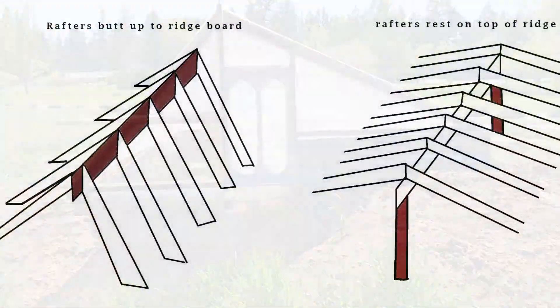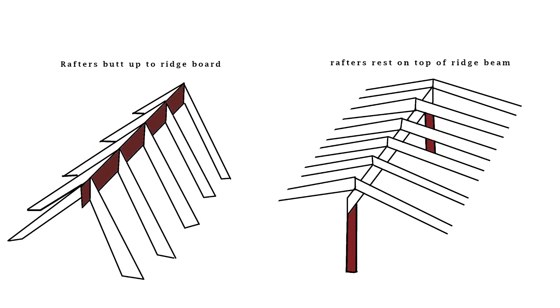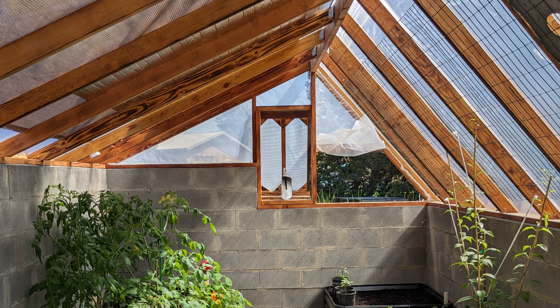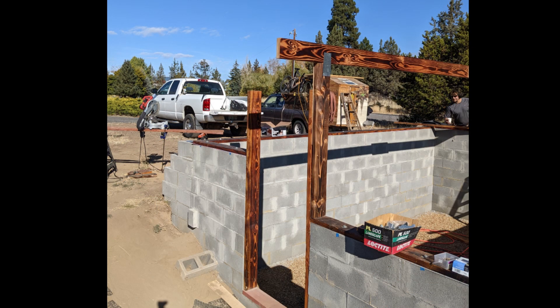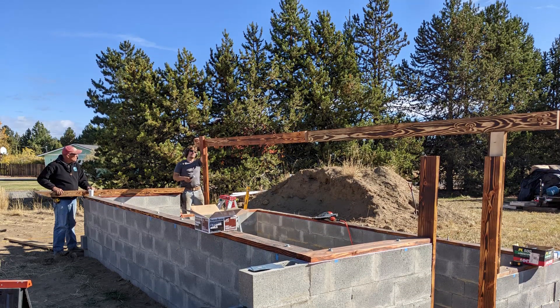The next question was which of two styles of roofs to use. One is a ridge board and the other is a ridge beam. The ridge board is used for roofs that are steep enough and don't need support in the center. The ridge beam is used for flatter roofs that need extra support because of weight considerations. My space was small and steep enough that I went ahead with a ridge board, although I ended up leaving the supports for it in case we get some heavy snow.